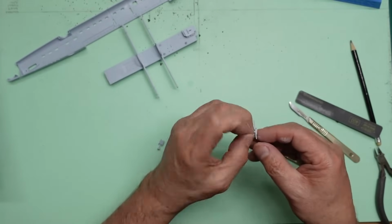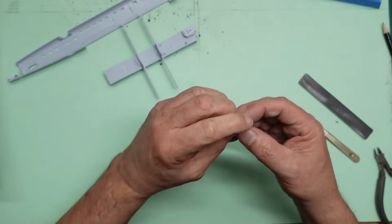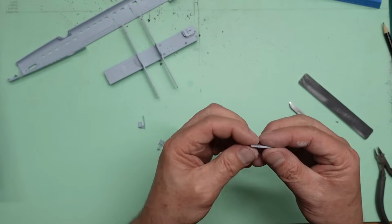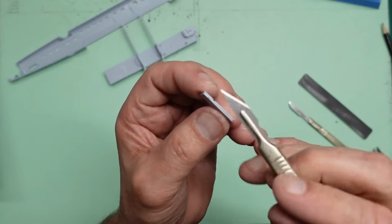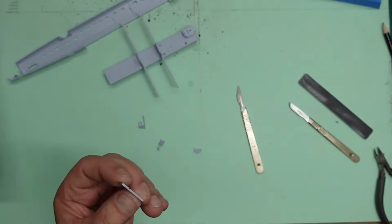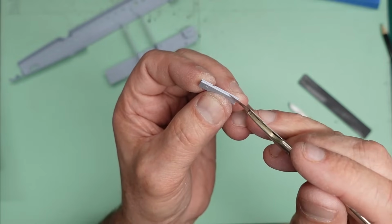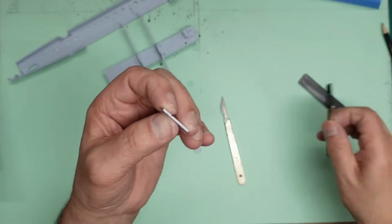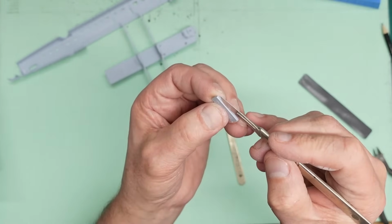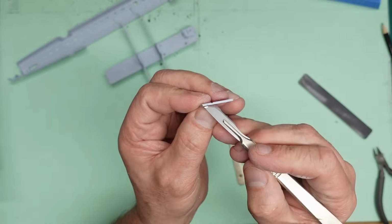Right. Well, I think we'll call that a day there with that one. The other thing is, on the table, sometimes this happens. It's unavoidable. You can see we have a sprue nib here, and it's on the edge. Get this light back over. It should look like this here, but it's actually causing us an issue. So take your radius blade and run it up against the edge, so it's nice and square, and then just roll the blade over, and then do the same this way.